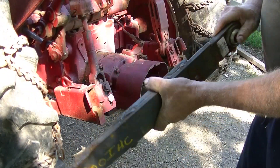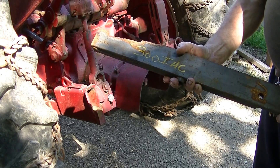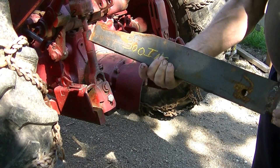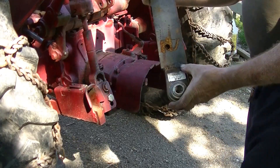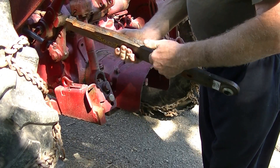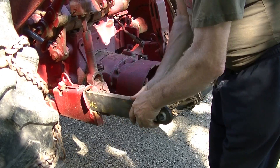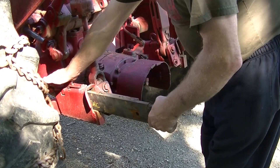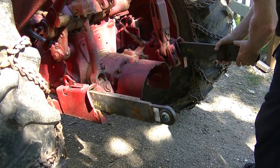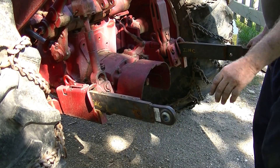I made up two of these — it has a similar tang that hooks into the release mechanism there. I didn't have any big heavy thick metal, so I bought these ends and welded that on, made it thicker by doubling up the plates. It's very crude but it works. So by replacing that hitch with these, I think it makes it into a category two three-point hitch.